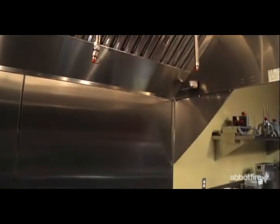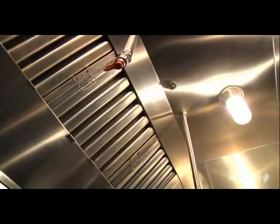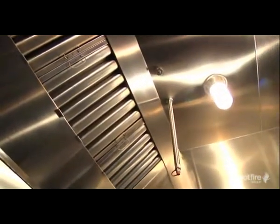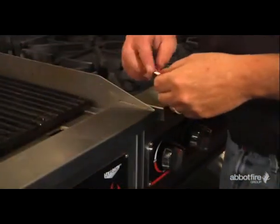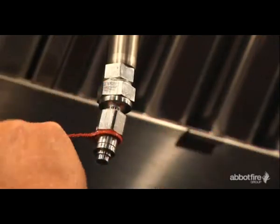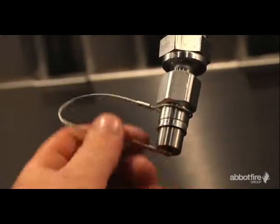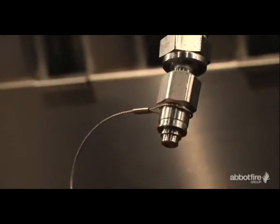Where inspection reveals defective parts that may cause failure of the system, the affected parts must be replaced or repaired. Rubber blow-off caps are checked for brittleness and are replaced annually. Metal blow-off caps are checked to be sure that they turn freely on the nozzle and are replaced if there is any damage.